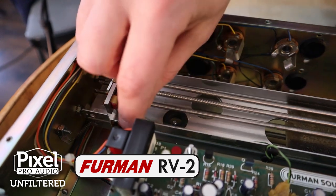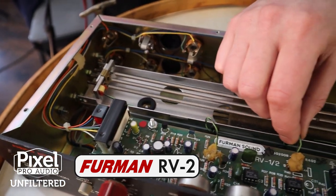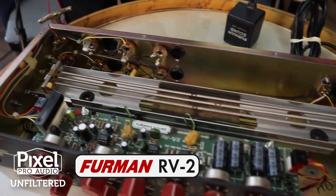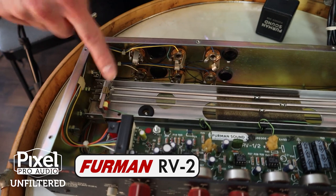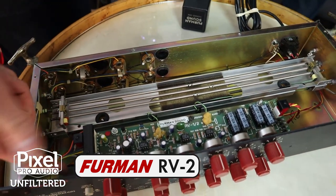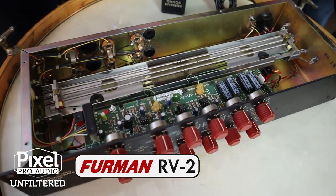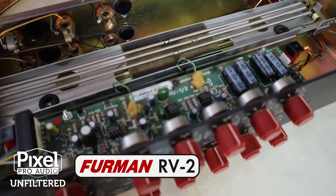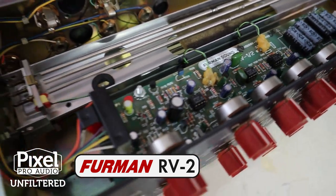Should we open this up? Let's check it out. So we have our springs here — you can see they're all jangling around. We should put a microphone up to that. On one end we have transducers on both ends — one end is sending signal to the springs and vibrating them, and the other end is picking up that vibration. You can see the cables go here. This is exactly what an RV1 looks like, just doubled up. Underneath this spring, totally reversed, we've got another spring, and then we've got two PCBs — it's exactly the RV1, just stacked.